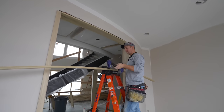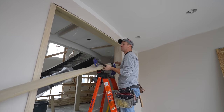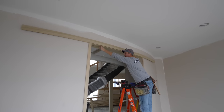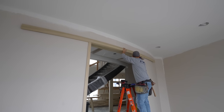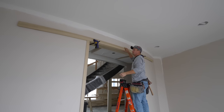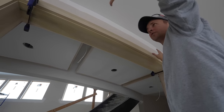This is what I glued up in the shop — this is our barn door header. The barn door track hardware will mount to this, so I essentially just need to make two cuts on the ends to get it to my desired length. To make this installation easier, we want to mark our center point so I know where the center of this whole apparatus is when I go to install it. I'm marking at 79 inches and pulling from the opposite side at the same measurement — between those two marks you can mark your center and know exactly where it is.